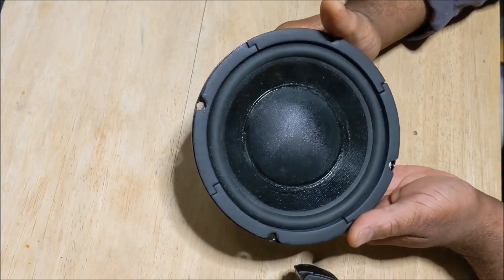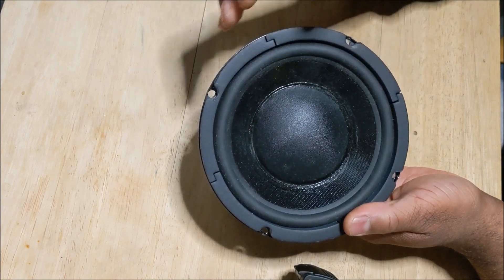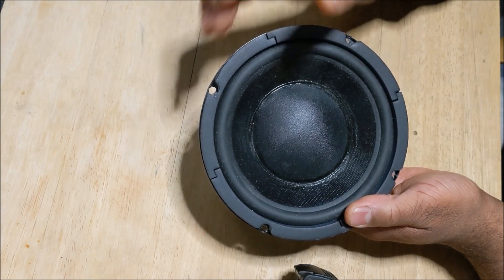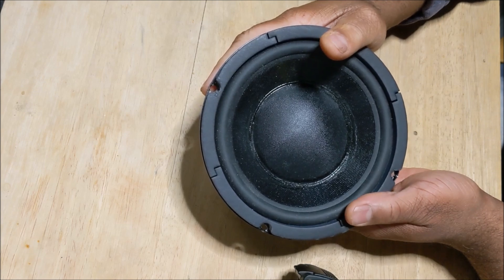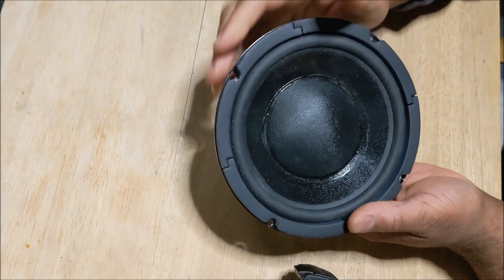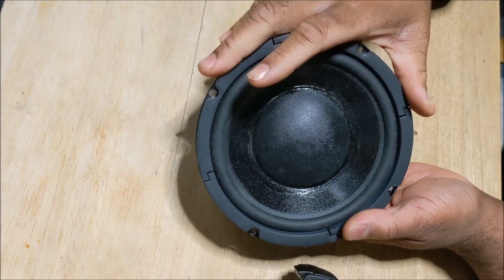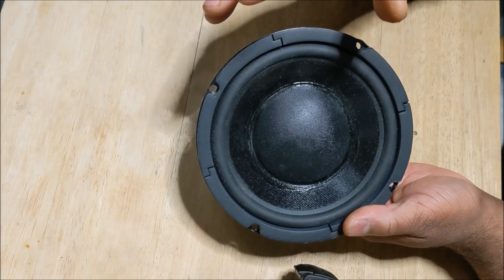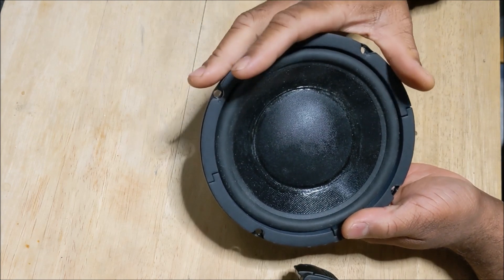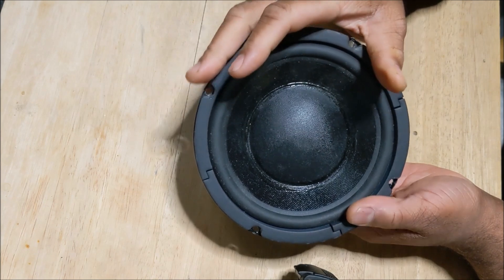Anyway, it really made a big difference. And this is what I'm saying — you can't really judge a driver on how it sounds just by looking at its response chart. A lot of the response charts you see from the manufacturer are not quite as accurate; in real life they're not going to be that flat. This is just a perfect example. Right now I'm going to show you what the manufacturer's chart looks like and then what my chart looks like from my own measurement. My measurements are not as accurate, but they do give you a good reading on how the speaker actually sounds.